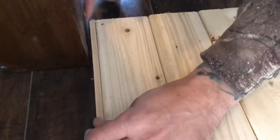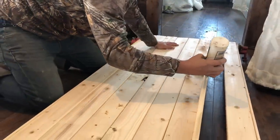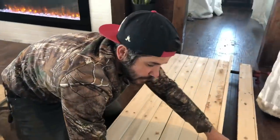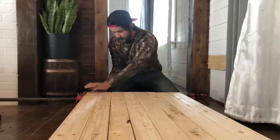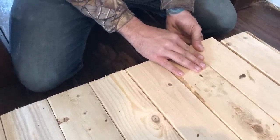Now with a piece on both sides, it fills in the gap a little bit better. Now that we've got the boards where we want them, we are gluing to get extra support and hold the boards together. I think most people don't realize how strong wood glue is — normally when you glue something and break it, it breaks at a new joint and not where the glue was. Spread it out and make sure whenever you're putting the board on, it's not going to drip down. With the pipe clamp, you're going to get the best product because you can squeeze all the gaps together. Make sure the edge is all together — this is going to give you a good straight line.